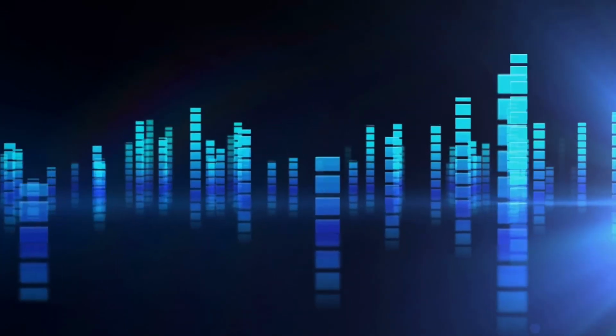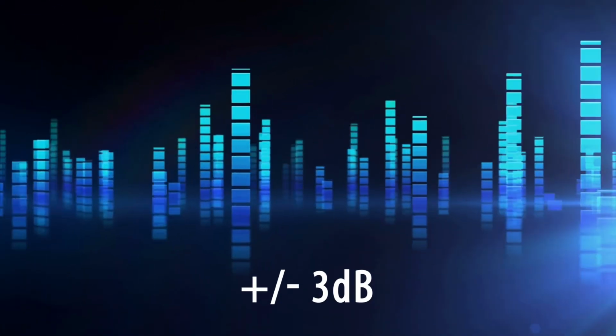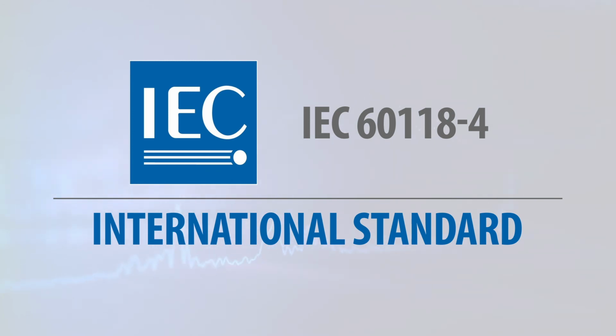There is a fair amount of disagreement concerning the necessity to maintain a ±3 decibel variation between frequencies, as well as across the loop field. Some experts say this is a requirement of the IEC standard, and others read it differently. Most of the people participating in the debate have not read the actual standard. This is one vague area that creates a great deal of division in the industry. The functional result is speech is diminished somewhat in a perfectly flat loop signal. Some people believe a curved response centering on the speech frequencies creates a more understandable hearing loop signal. Each installer should buy a copy of the standard, read it, and decide for themselves.